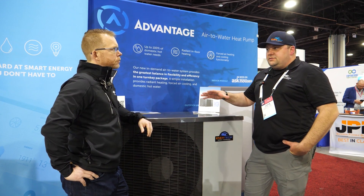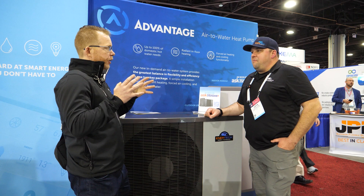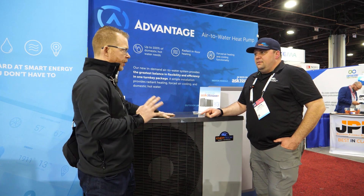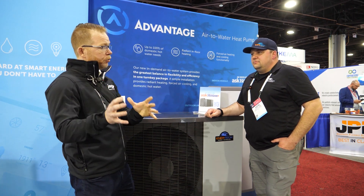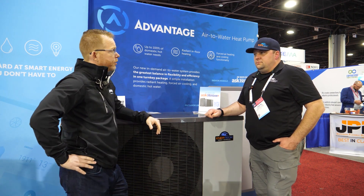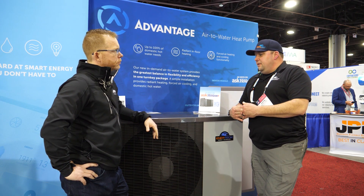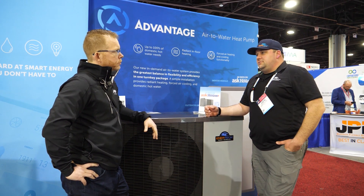When you look at the whole install cost to the homeowner, it's really comparable to what else is on the market if you're looking at a complete package system to do domestic hot water, space heating and cooling. You and I both know that 90% of the time, what kills this piece of equipment — whether it's air-to-water or water-to-water — is not the piece of equipment, it's how you piped it. As long as we have the correct size pipe and the right volume of water flow, we give the unit heating or cooling calls. It has its own built-in aquastat for domestic hot water. We're literally landing a thermistor on the indoor module. The two modules speak over a three-wire communication cable and it's pretty easy to install.